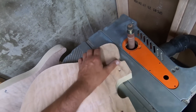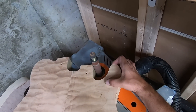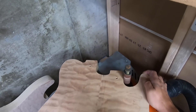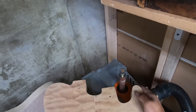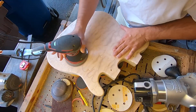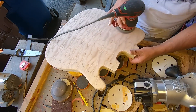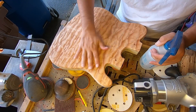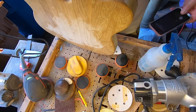For the top piece I'm going to use the spindle sander, and the horns need a little bit more love — this is after about 180 grit. Just back and forth sanding — lots of sanding on this one. There are some sanding lines from the drum sander. This quilted maple is slightly softer than a standard quilt top. We'll start with some 80 grit, wipe it down with some water, make sure I'm picking up all the grain and there's no glue line. Then when I come back with some higher grit, I know what I've got.